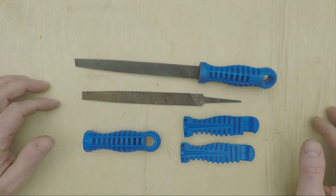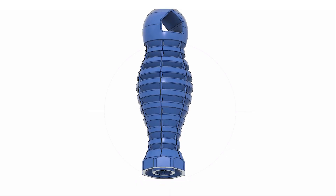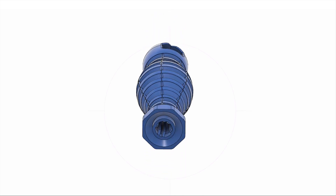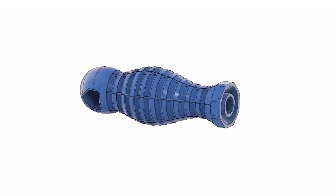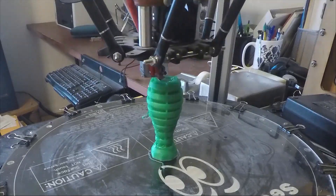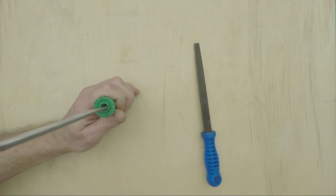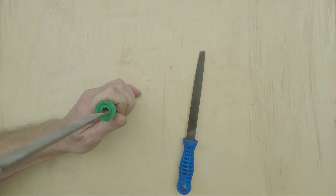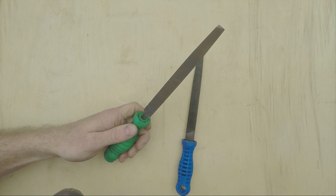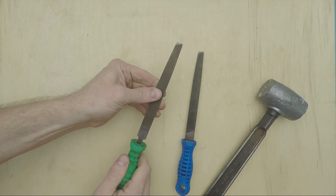Now that I can see how it works, I thought it might be fun to try and design a 3D printed handle that works in the same way. And this is what I came up with. It's not an exact duplicate of the Ferd design because their version is designed for injection molding, while mine is designed for fused filament fabrication without support material. Here it is coming off the printer. It's not a great print, but on first blush this handle does seem to work just as well as the commercial product.